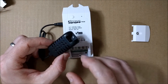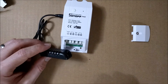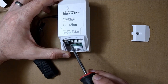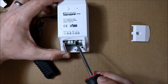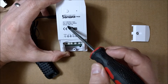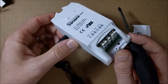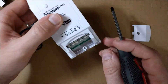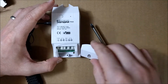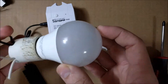Depending on how high the humidity or the temperature is, it will turn on and off automatically, or you can control it manually. To plug it in, you have the output here — the very last one. You have two earths or grounds, an input which is the hot 110, and then a neutral. This is a max load of 250 volts, 10 amps. There's nothing really to it. It has a little hole here if you want to screw it down to something.